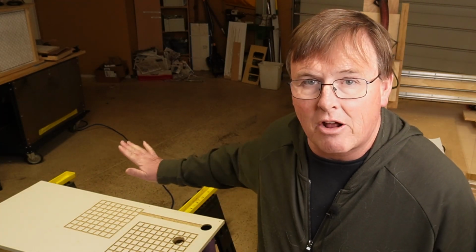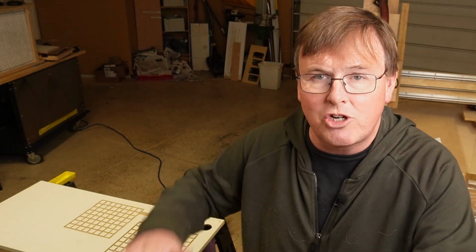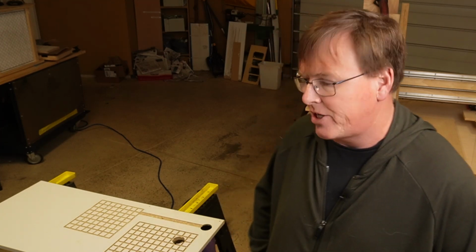I make no disclaimers. I will say this, have safety goggles on whenever you use one of these, and have an alternative way of securing down not only your melamine board to your surface or your spoil board, but once you get this vacuum down, I would put an additional security on the board that you're holding down, just as a fail-safe if this whole thing gives way because your vacuum either breaks or something gives. Highly recommend it. Now let's talk about machining this.